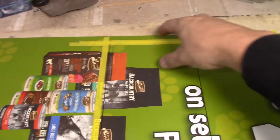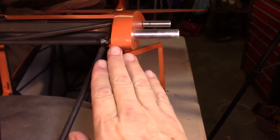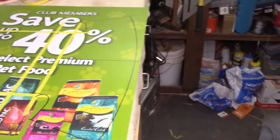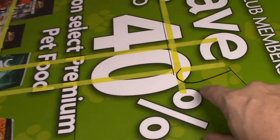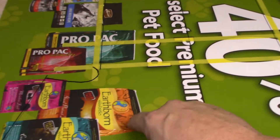I'm leaving about three-eighths to close to a half inch of plastic hanging off each side to put the screws in — across the back, across the sides. Where it gets tricky is because of the way the windshield cuts around: it comes across the top and right in here where it comes over the top it goes into a rotation where it's going to get attached. So there's going to be very little covering right here, and that's why windscreens on these things are very difficult. If it was a flat sheet like a windshield on your car, that would be a piece of cake.